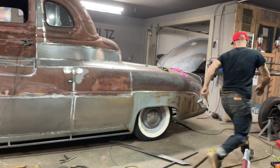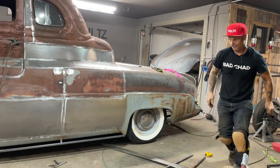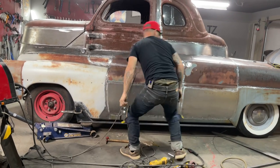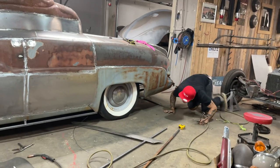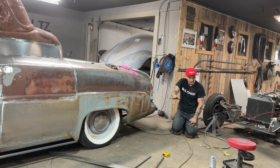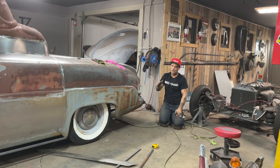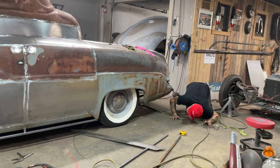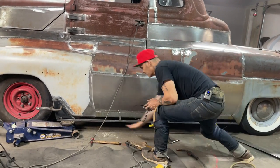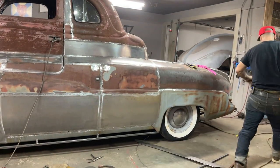Want to bend it down a little bit, that's all. Go easy, Hiltz. Now I'm happy. What happens is I've got a nice roll going on this way. One part was tucked up a little bit where I was hitting, and I just want to bring it down to have a high spot instead of a low spot. High spots you generally don't see, lows you see. If it's tucking up, you'll notice it. So basically that's what I'm trying to get out of it.